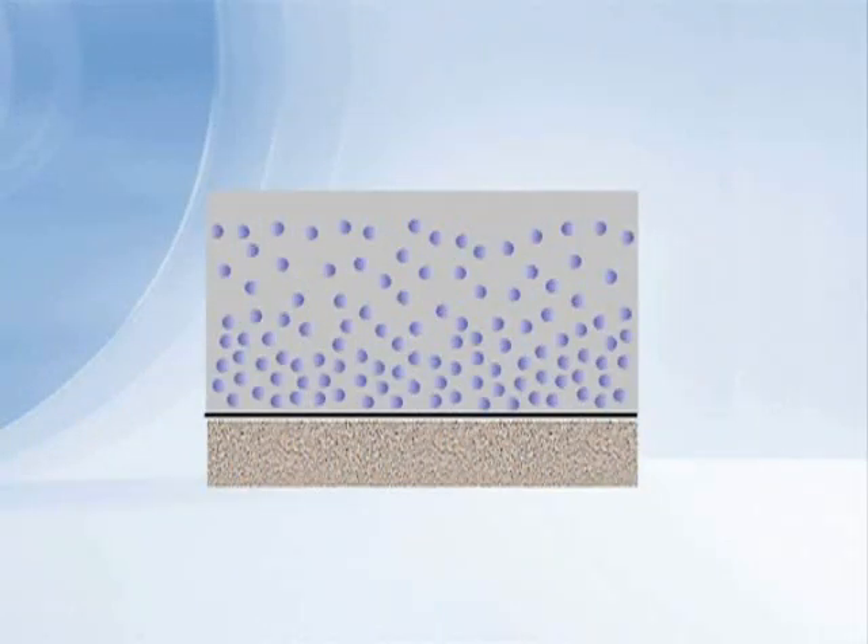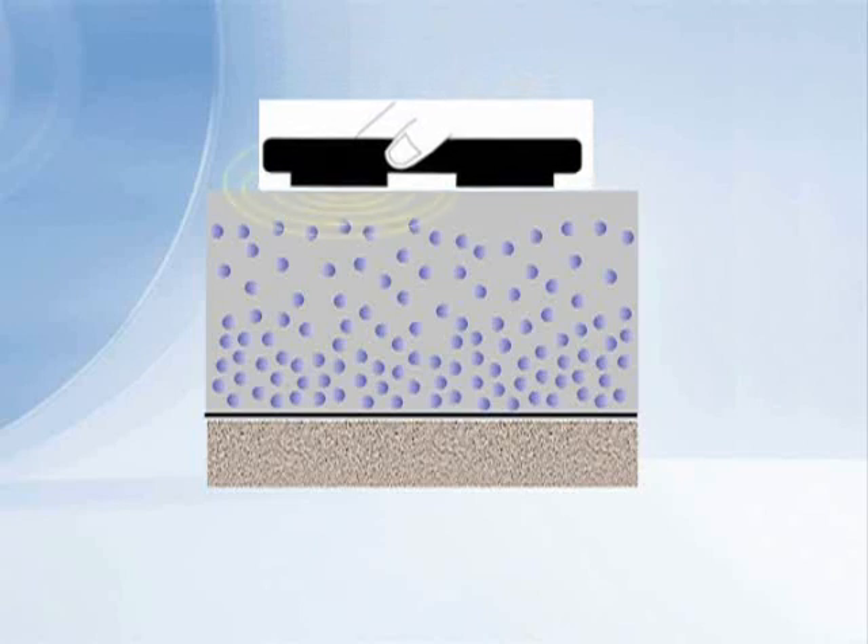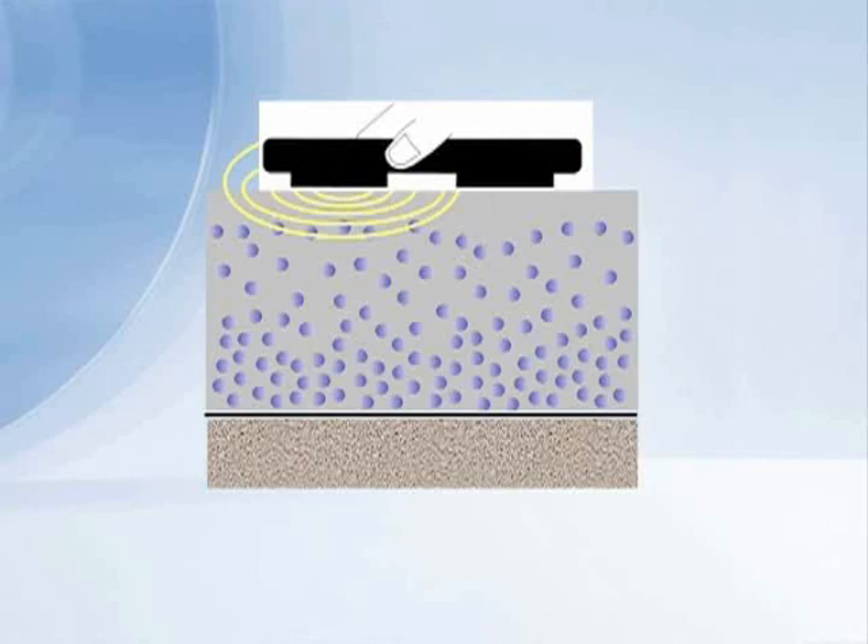On this next slide, you see the representation of a hand-held electronic meter, and there's a little animation showing the electronic field that's put out by the meter at the surface. These meters are tuned and manufactured so that they only indicate the moisture in a shallow region, roughly the top inch of the concrete. The reason is they're putting out an electromagnetic field.